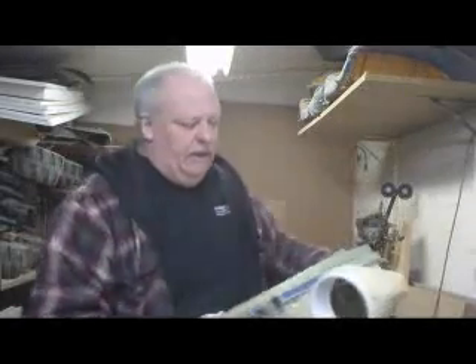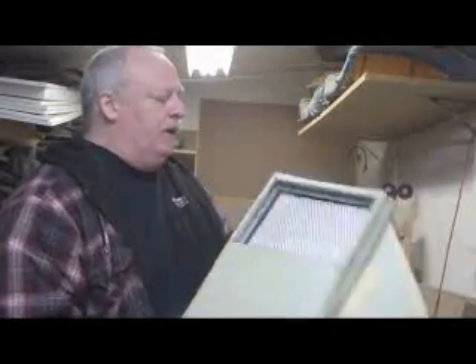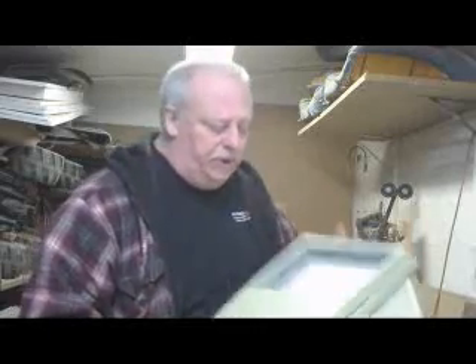It comes down into my air box. I really wanted to show this — it's kind of cool because of the technique. I built RC planes, and one of the things I used to do — I didn't invent this, I just worked on it and perfected it for me — the technique of taking foam and sealing it with wood glue, a thin layer of wood glue, and then putting fiberglass on it and newspaper, almost like paper mache, making a shell for RC airplanes. I did some testing and it's amazingly strong — crazy strong — with just fiberglass, wood glue, and newspaper on foam. I literally could not break a piece of it with my hands, and I put weight on it and couldn't actually get it to break.